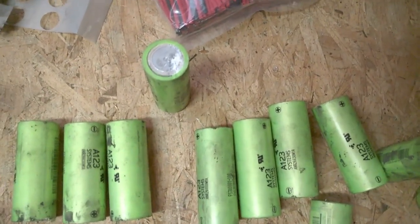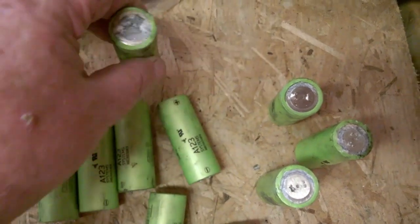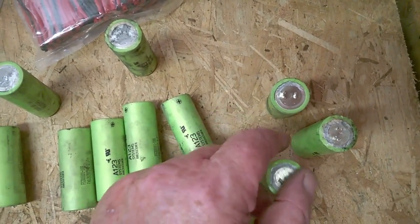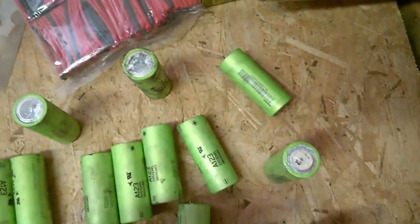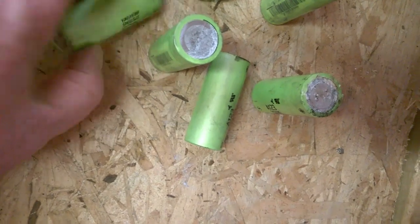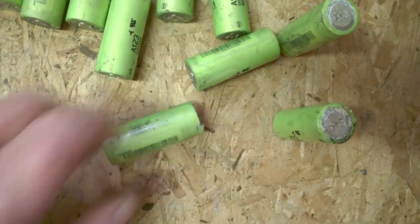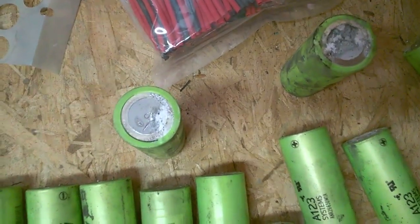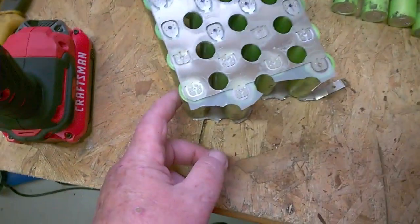Here's what I'm talking about - you've seen it on the other video, the first part. Corrosion gets underneath this cap here, underneath that little plate, and pops a plate off the battery. From there on things get worse. I don't have an answer on what we can do - how to get that corrosion off there without tearing the batteries all apart and recompiling them into a whole new configuration. It's a bit of a shame - most of them are good. The only way to tell is to take them all apart and check every cell, make sure it's not loose.